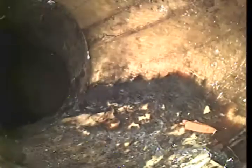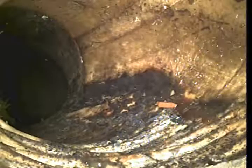Pull back in. Everything looks good here. They went right up to the city sewer saddle, tying connection with the liner. You're not supposed to go quite that far with the liner, but in some respects it helps the homeowner. If they lap it just a little bit like this, then you don't end up with root intrusion there.